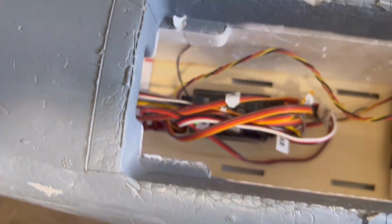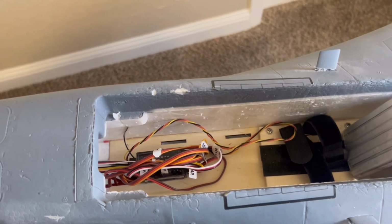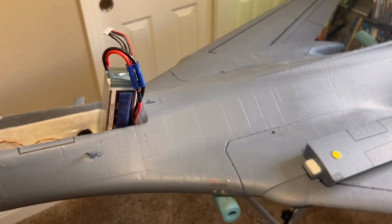So now we'll go ahead and plug this in. And I'm going to try to hold the phone so you can see what happens. It's not really the easiest to do, but here we go. 0 volts, speed, 100. Okay, so now it's a green light. Here's the ESC. I just put it down to 0. And so I don't really think that calibrated it, because now I'm going to show you the way that I normally do this to calibrate it, and it's a completely different sound to the ESCs.